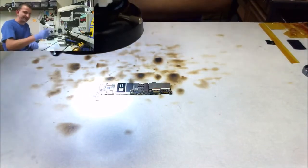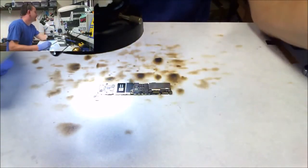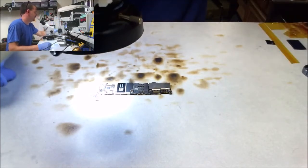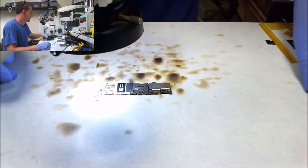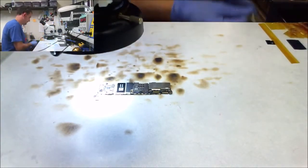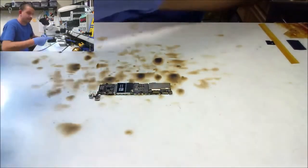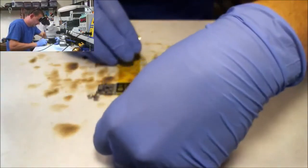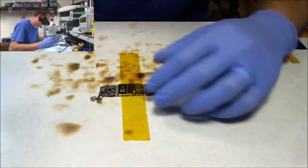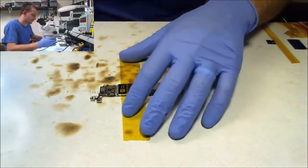All right. I don't think I'll be able to wick with that micro pencil on this one. All right, I'm going to shoot for about 380 C on hot air. Actually, 375. I need to get one of these that has a knob, because it takes me forever to get to 375. There it is. Sounds about right. Let's go ahead and attach this board to my stand here. There we go. Just there on the stand where it belongs. I didn't put any tension there, just enough to keep that board from sliding.